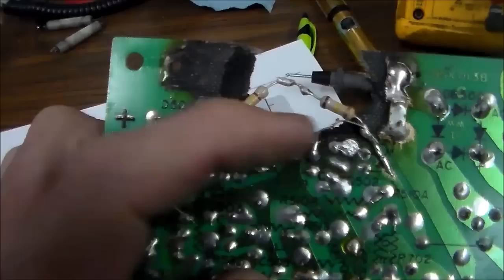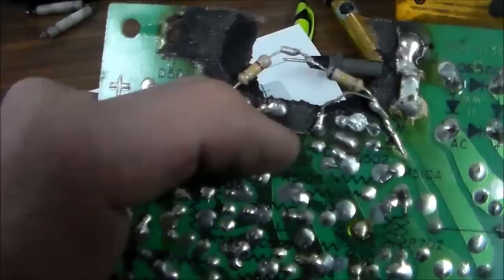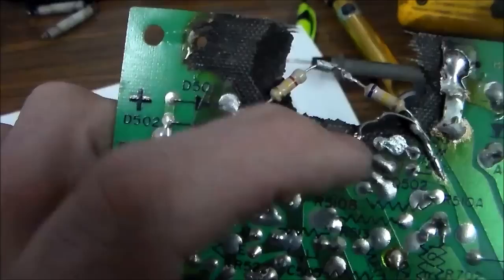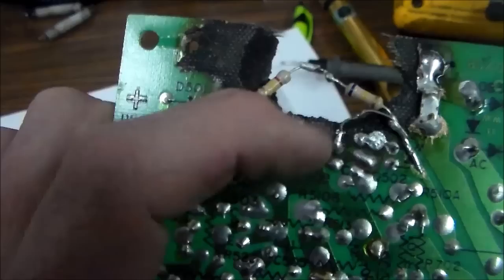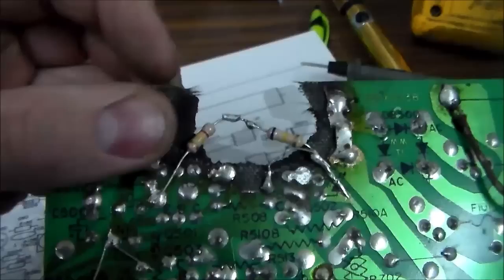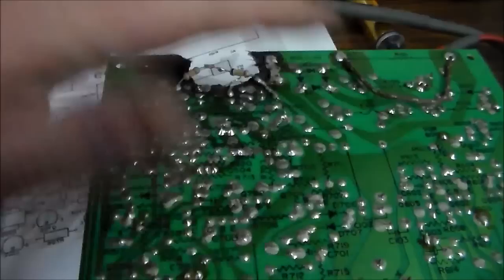There would have originally been a resistor there that burnt off of the board, so I had to rig it up. Okay, but that makes the connection. And then the last thing is the right side of that resistor that's missing, and the two resistors below it were connected to this little trace. So the top resistor I replaced that's on the board, and then I ran the jumper over and grabbed it. So everything's real good. The only thing I'm not super happy with is this bridge here. But I ran it up like that because if I ran it down low, it'd be easier for it to bend over and touch something that it shouldn't. So the main issue would be if this moves backwards and shorts against the frame behind it, which I guess any of this could do, but there's little standoffs to keep it all from doing that.